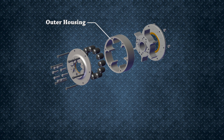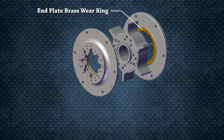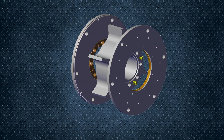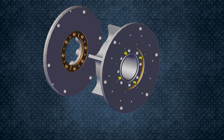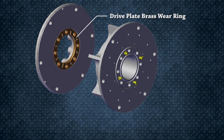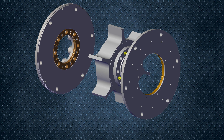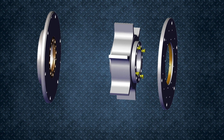Clean the old grease off the inner hub and brass wear rings. Ensure wear ring hardware is secure and not broken. Then place the drive and end plates back onto the inner hub, checking for excessive wear in the brass wear rings. Brass wear rings provide a renewable bearing surface for the coupling when operated as a flexible connection. If any of the wear items require replacement, PowerTest can provide a coupling rebuild kit. Please contact us for more information.